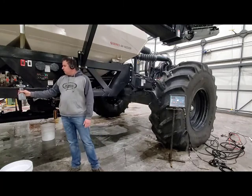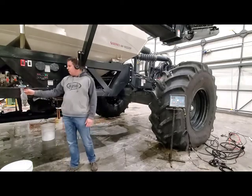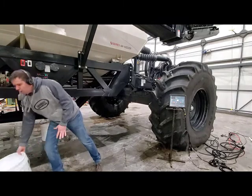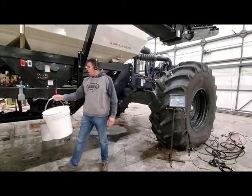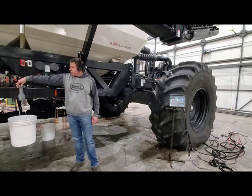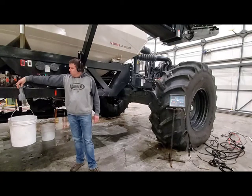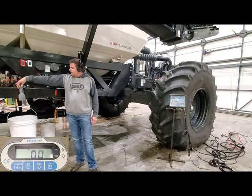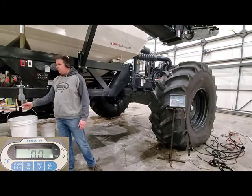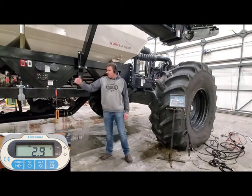Also, find your digital scale. With the scale that's sent with the 9000 cart, it'll hold a tare weight for you. Turn the scale on. Find one of your pails or whatever you're using to calibrate with. Hang it on there. And then, to get a tare weight into it, just push and hold the on-zero button for about 5 to 10 seconds. Once you hold it for that 5 to 10 seconds, let go — it should show zeros on there. And then when you take the pail off, it should show you the weight of the pail and what it has in there as a tare weight.